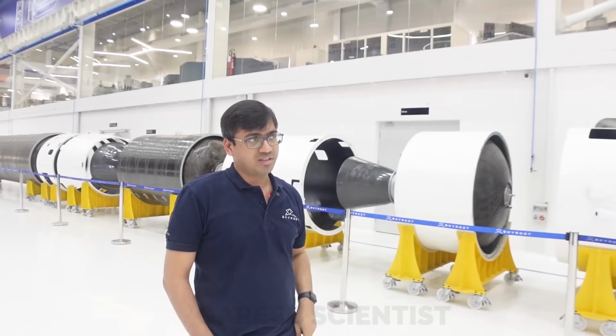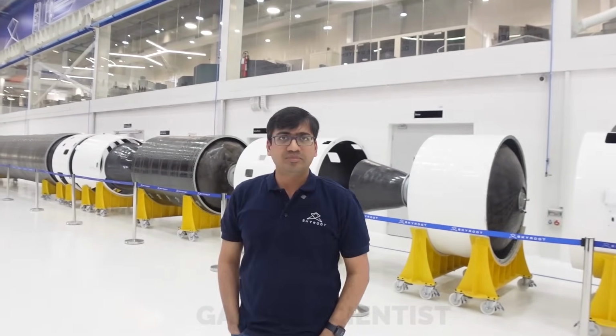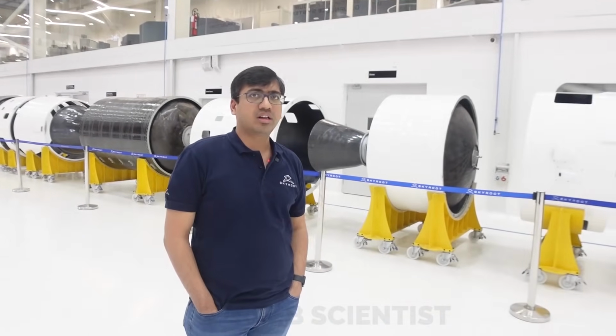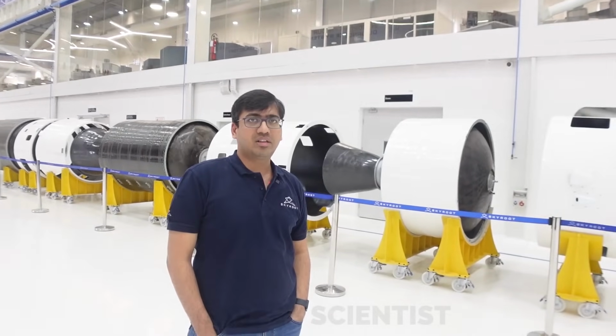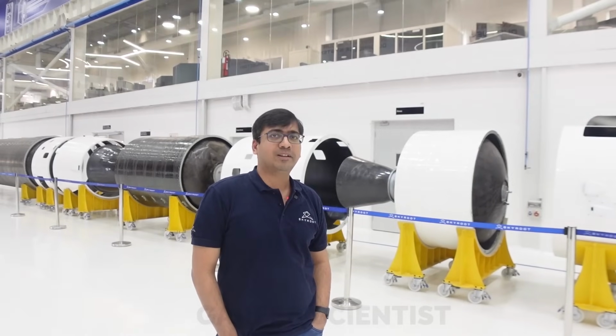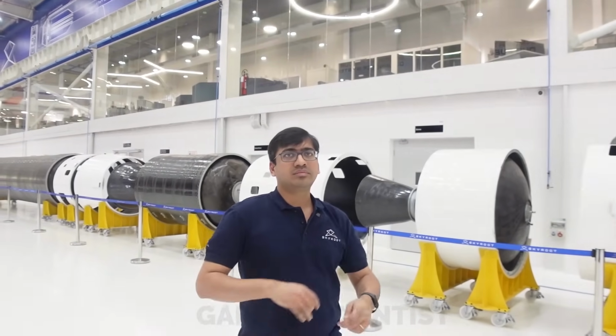And so you avoid big pitch yaw thrusters, which would be required for a fixed nozzle. And we realized that gives a good payload gain. So we put a TVC system here as well. So all three stages have TVC? All three stages have TVC. Which means they require big batteries? Not very big, it depends on the actuator. The first stage requires decently big batteries, and the second much smaller. Third is much, much smaller. So you were talking about some will require retro motors, some might not require.